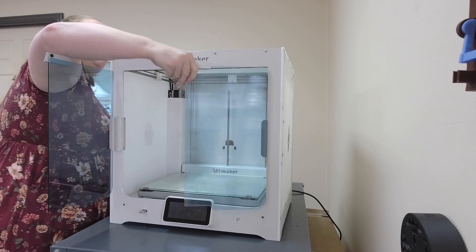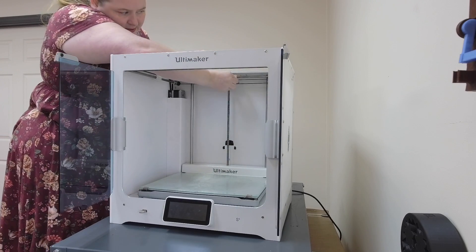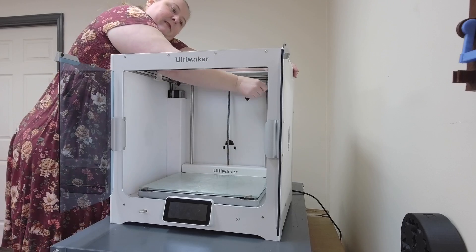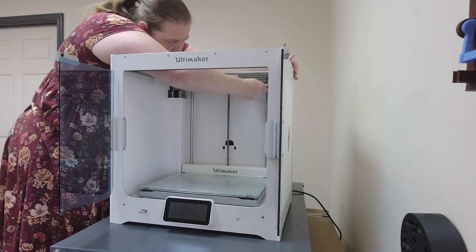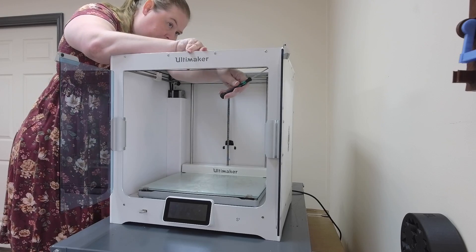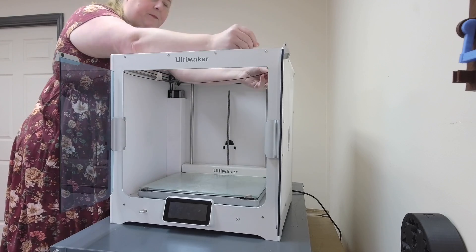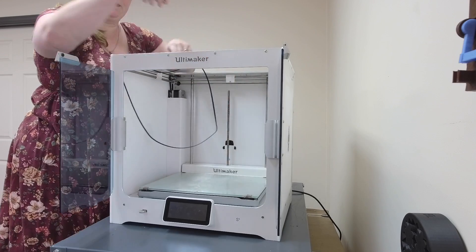Open the doors and pull on the rear sliding block until it's in alignment so we can get the screwdriver into the set screw on the pulley on the lower rod in the back right. There are two pulleys in that corner, so make sure to get both of them. Then come up to the front right corner and loosen that set screw pulley as well. Grip the rod and slide the whole thing backwards — be careful not to lose the spacer. Try to grab the pulleys and spacers as you remove the perimeter shafts.